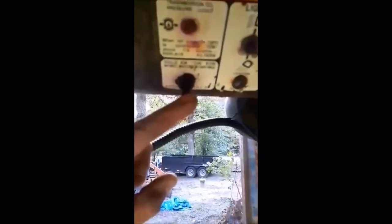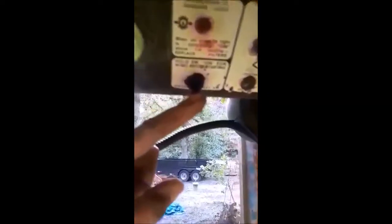Make sure this lever is in neutral or it's going to want to travel while you're cranking it. It says hold the key for 60 seconds to charge the glow plugs — you can actually hear them come on. Turn the key on and listen. Good voltage — brand new battery showing 13.0 volts. Let's try three-quarters throttle and see what she does.